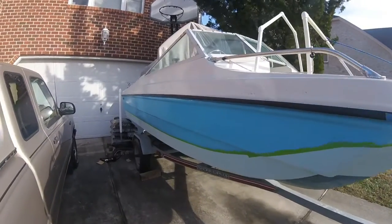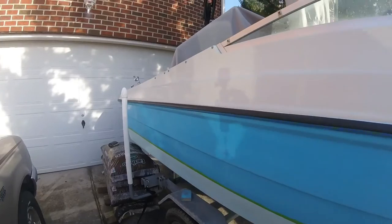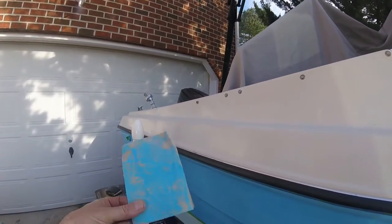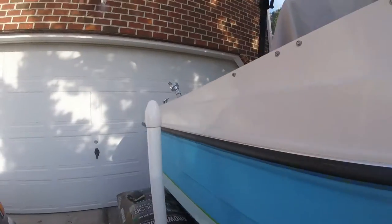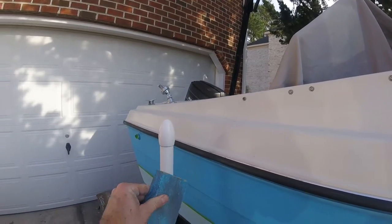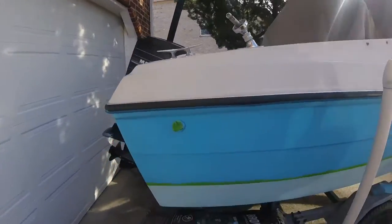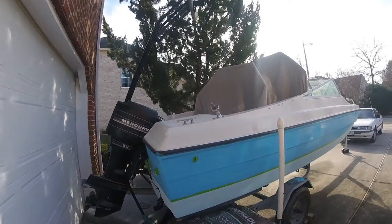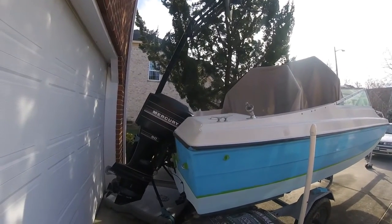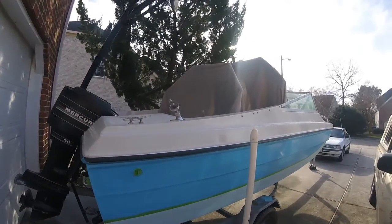Getting ready for a second coat of paint and I just used 220 grit sandpaper. I used the sanding block, just one of the soft spongy ones. Boats have so many soft edges and rounded edges, it's better to use something that you can get around — it's not a very flat surface in many places.